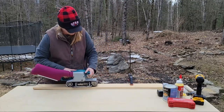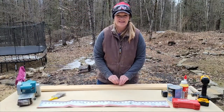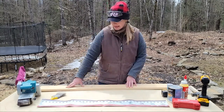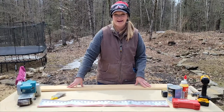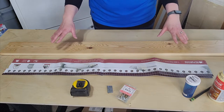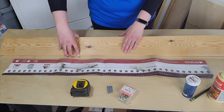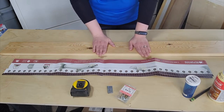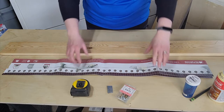I wanted to get a nice smooth surface so that when I put the varathane on, it's going to fill all those cracks with no voids, so my sticker will adhere to it once it's dry. This is going to take a couple of stages, so I'm going to start putting the first couple of coats on now. Now we're into day two of this project — I went through and did a total of three layers of varnish on my board, sanding in between to make sure it was as smooth as possible.